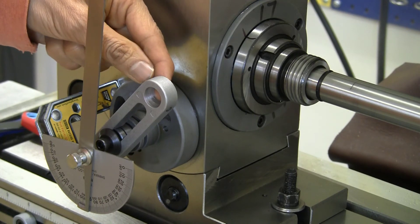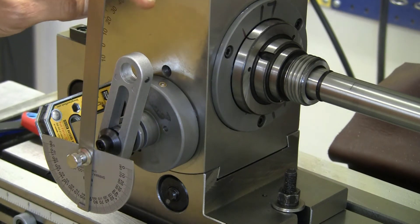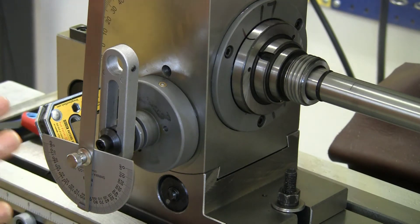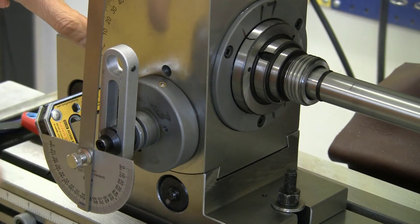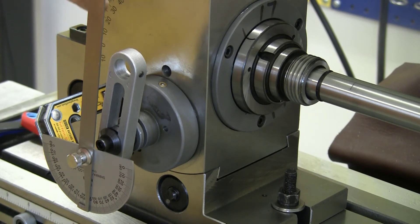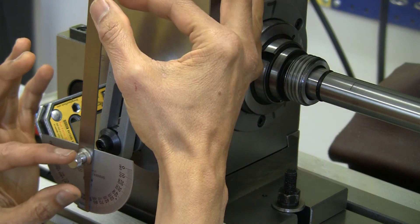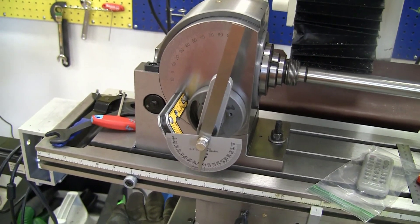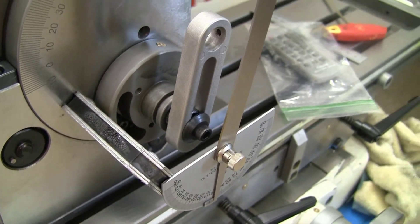As I move the handle you should be able to see very slight movement along the sharpie mark. I'm going to bring the handle to a close to vertical position and then gently push it back in the clockwise direction. By eyeballing I will try to estimate how much angular change at the worm shaft is required to make the spindle start to rotate. I move the handle ever so slightly until I can just feel the worm engage — I measure about 6 degrees. That translates to 0.15 degrees at the spindle because it's a 40-to-1 rotation advantage, which is about 9 arc minutes. It's certainly possible to make it tighter, but I think this is a fair compromise.